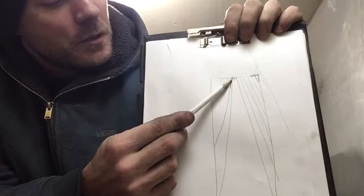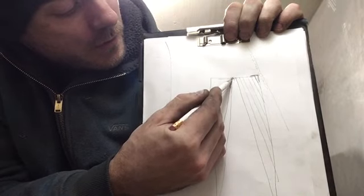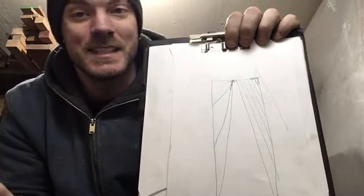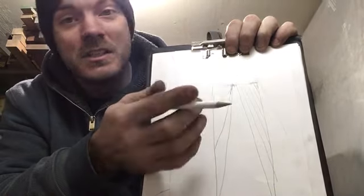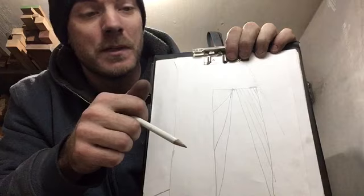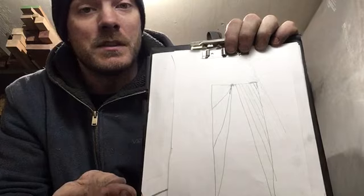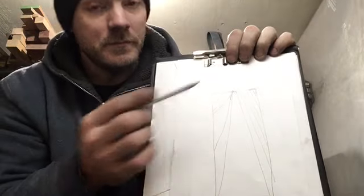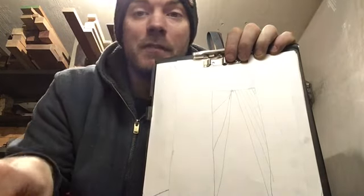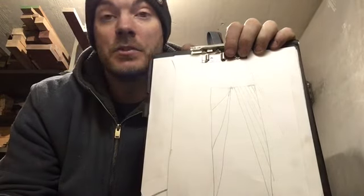And then if you have this little extra angle in here, it's going to be tiny. Again, we're talking about the edge of a blade here, right? So it's a tiny little bit. Even if you leave that until finishing, it's no big deal after heat treat. Or once you've got your bevel in, you come in, put a little extra pressure on the edge side of things and squeeze that over closer to your center line, and it disappears in a pass or two. It's no big deal. So that's how I'm going to grind, and that's how I'll show you grinding. And you're just working that bevel on up the blade until you get to the height that you want to heat treat at.